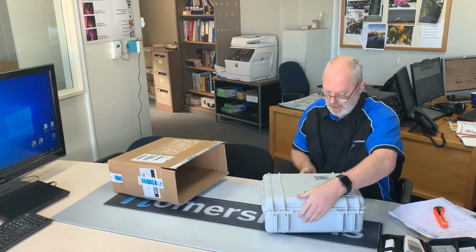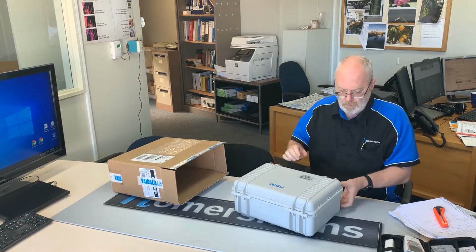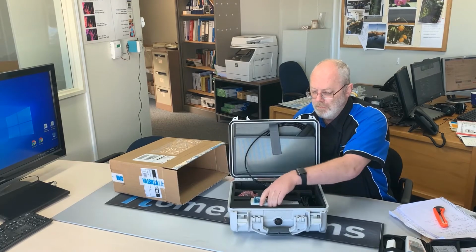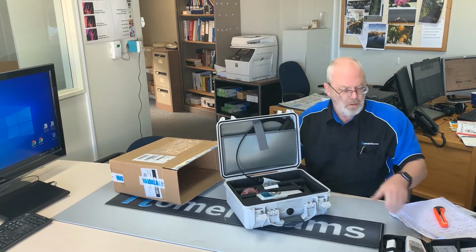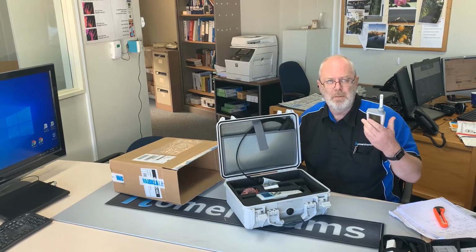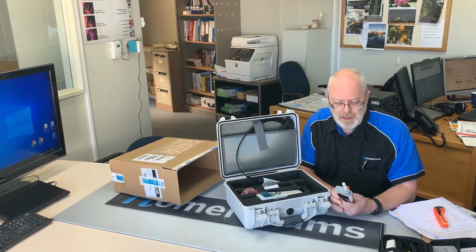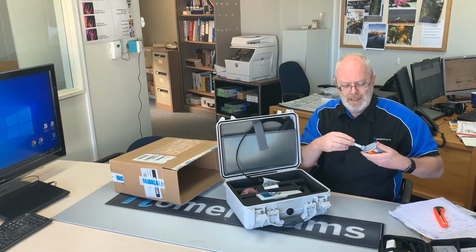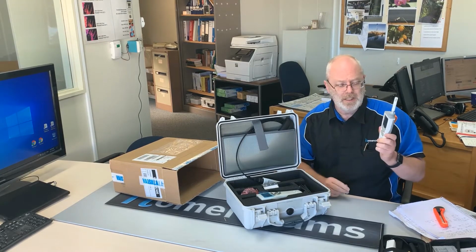And here is the HM70. The other claim to fame of this unit, amongst others, is its temperature range and its ability to deal with difficult environments. Its little brother, the HM40, can deal with 60-degree humidity, and it will recover from 100% humidity. Many instruments will not. At 100% condensing humidity, one can get moisture forming on the sensors of the probe. In the case of the Vaisala HM40, that will recover 100%, no problem.